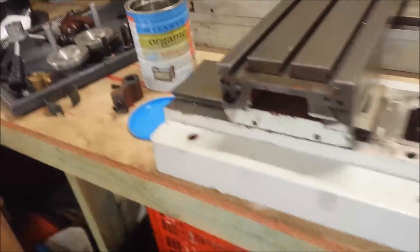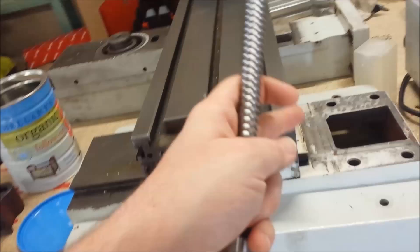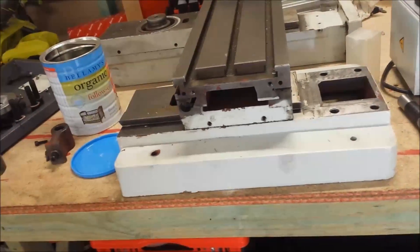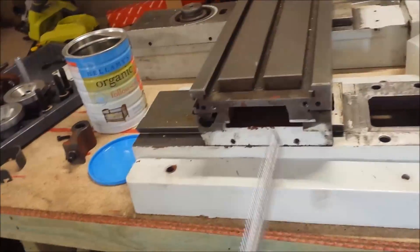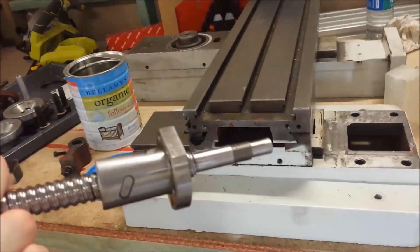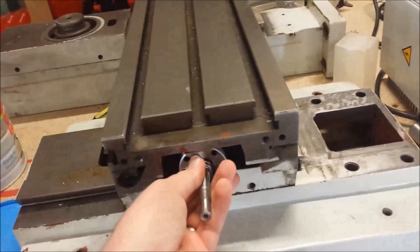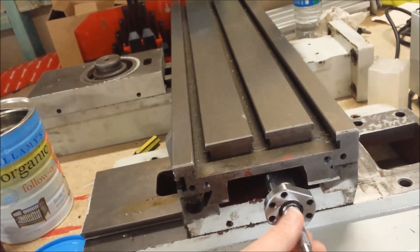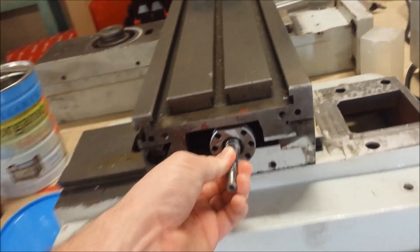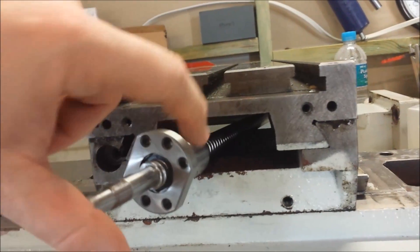Now for the big axis — I don't really want to do any machining on parts. I don't want to be grinding down the table and doing that sort of thing; I just want to be able to fit the ball screw and be done with it. I'd rather get other people to machine some parts rather than getting in here with angle grinders. I've got a Chinese ball screw left over from a previous job, and when it goes in here it doesn't fit underneath — the height is too thick so it won't slide in underneath. But you can still get a fair amount of clearance, resting on the actual round part.